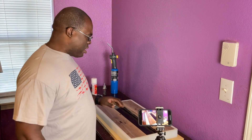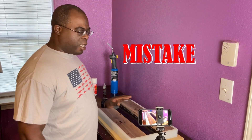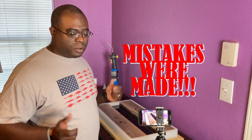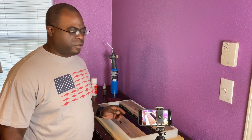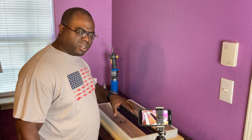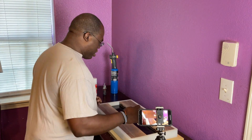We're back — it's been a few days and the epoxy is fully set, but it looks a little different than when we left it. The reason is I made a mistake and mixed up the epoxy at the wrong ratio. I did a two-to-one ratio instead of the required one-to-one ratio, so I had to take everything out and start over. This time I poured a half inch thick layer of the thick set epoxy. Now I need to scuff up the epoxy with 120 grit sandpaper so our clear layer will bond to it really nicely.